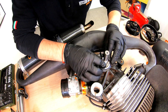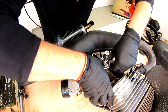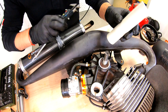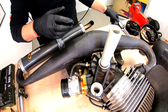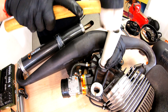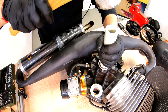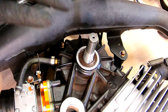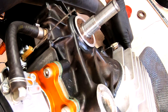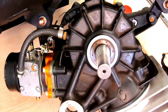Put it on — very easy, smooth. Be sure that the lip is going all the way around. Now, with a PVC pipe with an inner diameter of at least 20 millimeters, you can press this on. It works like magic — it's plastic, so you will not damage anything. I like to use a rubber mallet; everything rubber will not damage anything. We will press the seal in. Be sure that the seal does not go below the level of the crankcase — make it flush. Be sure the seal is flush with the crankcase at the same level. This seal is in — very simple and straightforward.